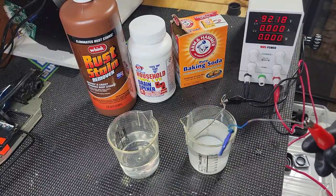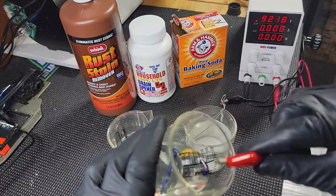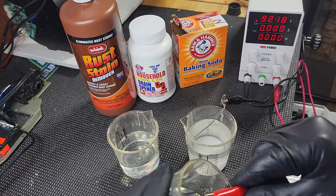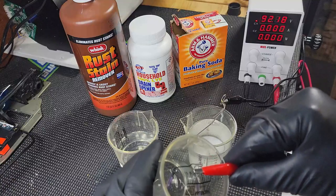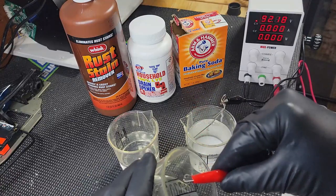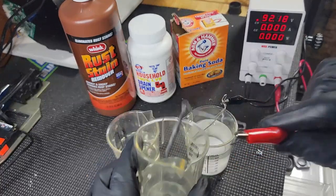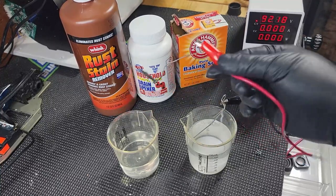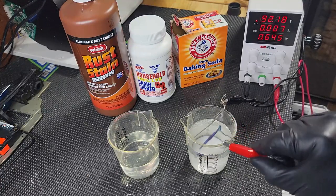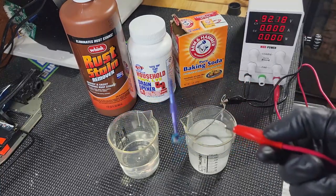As you can see it's pretty simple — it does take a little bit of respect for the chemicals. If you put it back in the hydrofluoric acid and rinse off a couple of these layers, you can make it back down to the raw state. You can see it going away there — back to raw titanium. And just as quickly, if I want to go back to that deep purple-blue, dip it back in for half a second and get the color I want. That's a nice blue-purple.